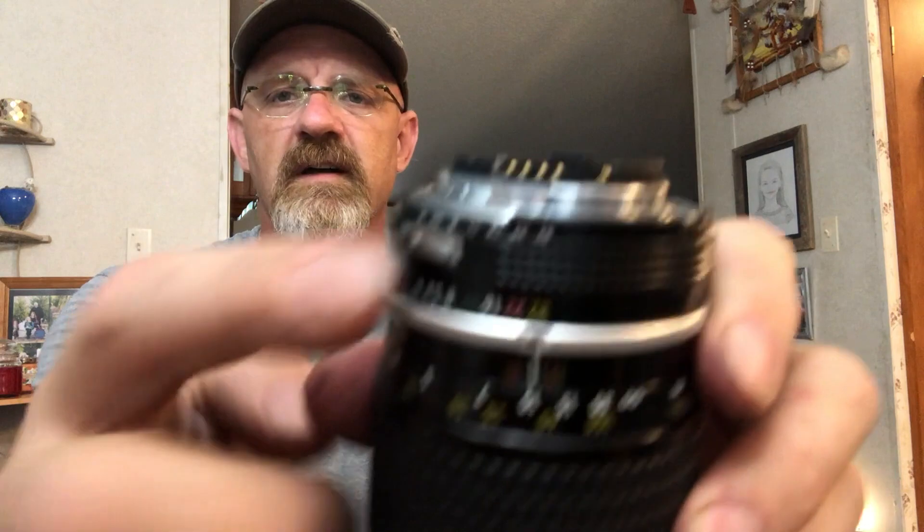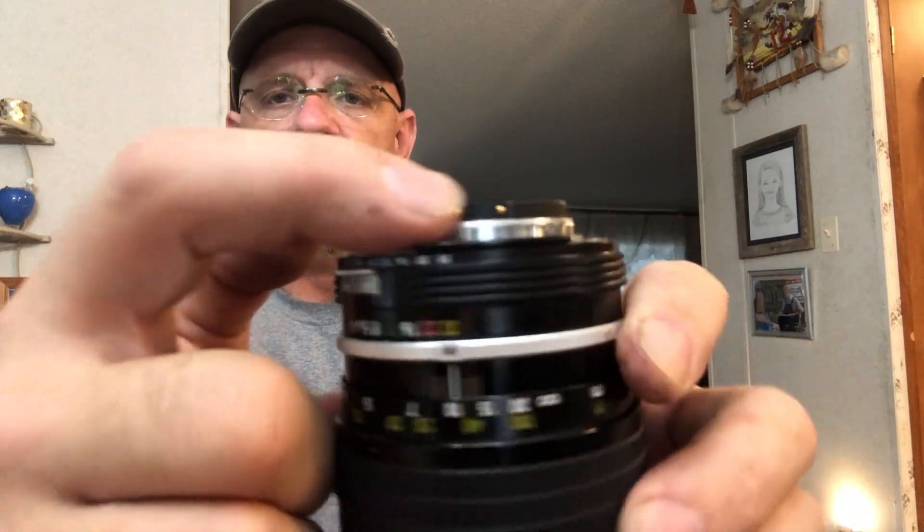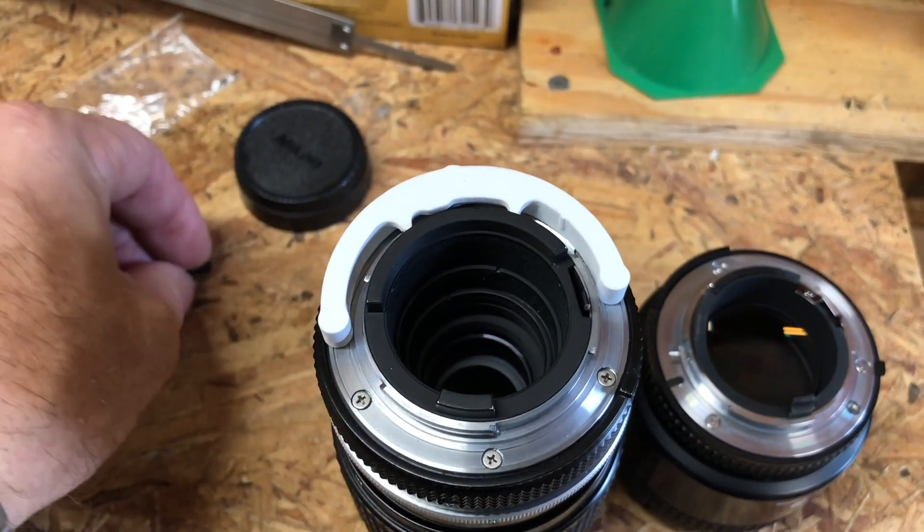The little chip, as you can see, is right here. All I did was mill a notch in this aluminum wall for the chip to fit in there. It's a clearance cut — a little bit bigger on both sides, not a perfect fit, and it doesn't have to be a perfect fit. It comes with a fixture — that little white foam thing — that fits into the lens lock pin hole, loops around, and creates a location position for your chip to hold it in place. It was actually pretty simple. This was an AI lens, so it wasn't exactly a correct fit — I had to get a little creative. That's why I had to mill the shelf.